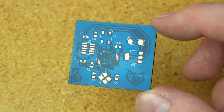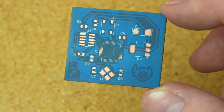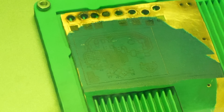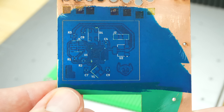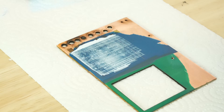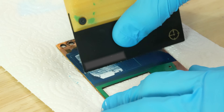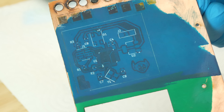There's also a cheeky technique where you can actually put the silk screen layer on a board too. On this blue one I did this with white text, and it came out really good. You ablate away the solder mask where the text should be, and then you squeegee across a different color solder mask, using a little IPA wipe to remove as much of the top surface as you can so it kind of stays in the wells that you just cut.